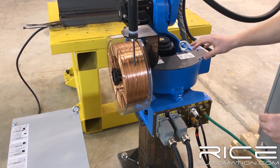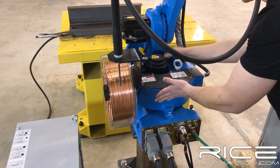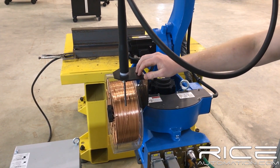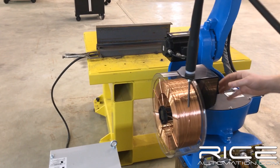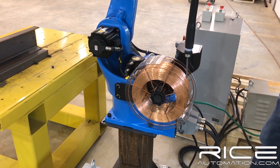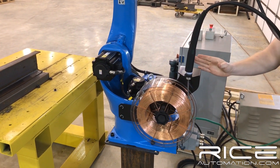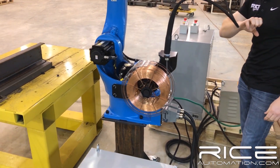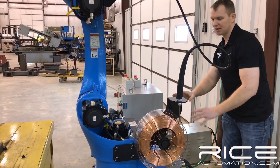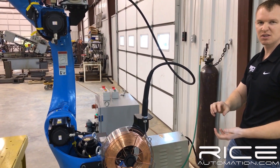Moving on up to the J1 here — we still have a nice, robust, heavy duty casting on this thing, super heavy. That in turn allows us to put the wire reel right here on the J1, along with a plastic shell to keep it from unspooling. We have everything we need to feed this thing and get our wire to our wire feeder. Generally among robots you'll have a power cable coming off the back of your feeder and something to feed the wire — here we have everything integrated into this one robot, nothing coming off the back. It just makes it a lot slicker of a design.